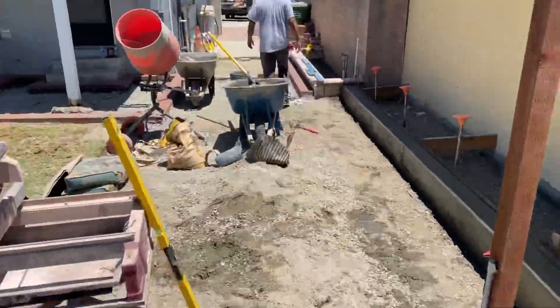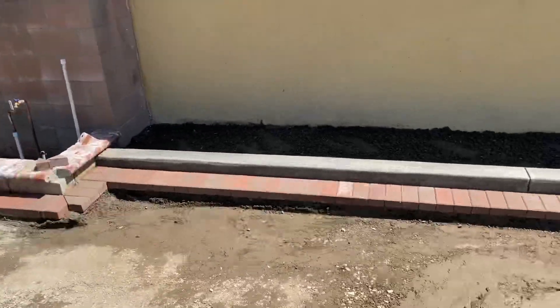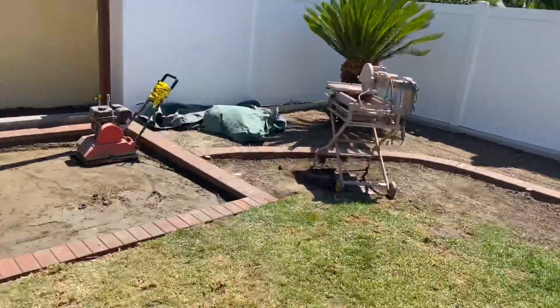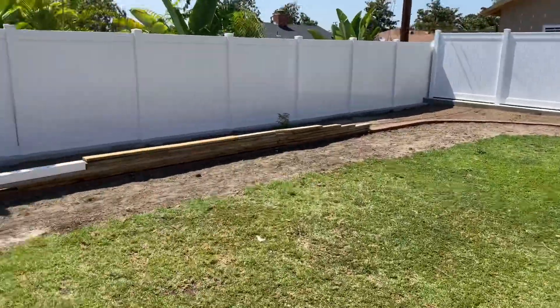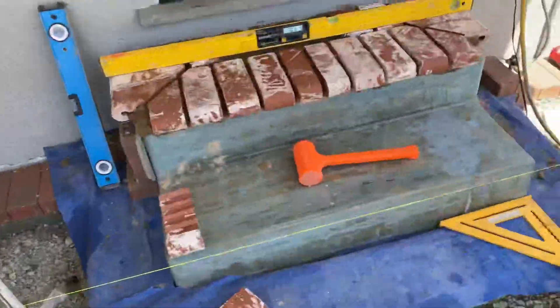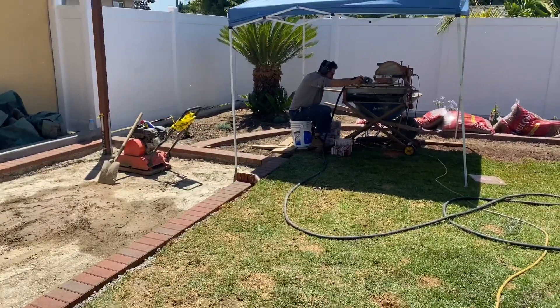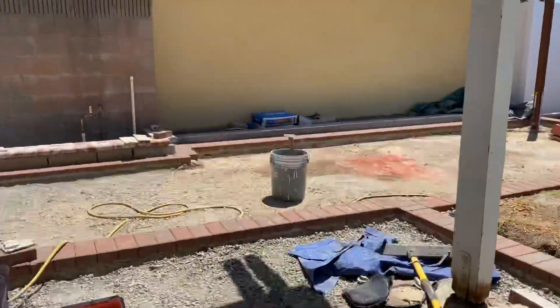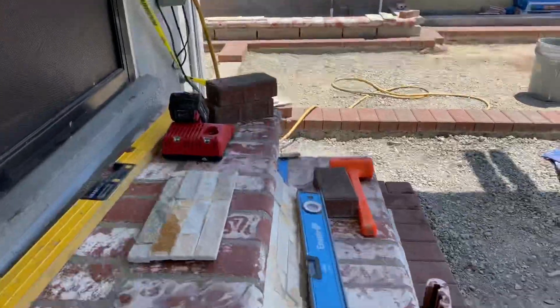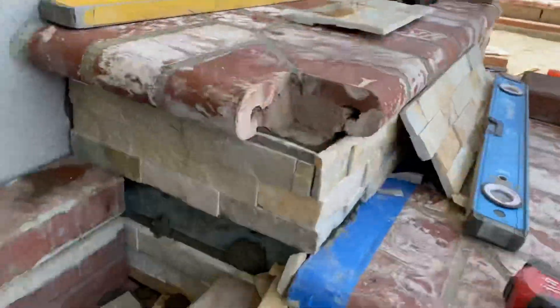Here you can see the paver border done along the backyard, also bordered up for the inlay of the paver floor near the house. The planter is done, the curb is poured for the garage section, Mexican pebbles over here, Mexican pebble planter, and steps. We weren't going to leave the old concrete — we remodeled them into brick-capped bullnose stone steps. Anthony and Jonathan handling the cuts, I was handling the brick lay. You can see the stone partially done for the backyard door steps.